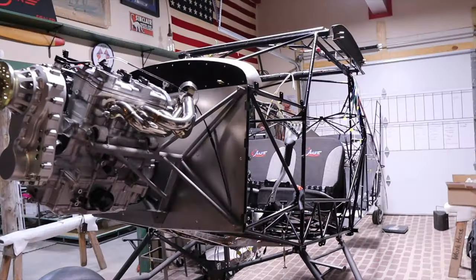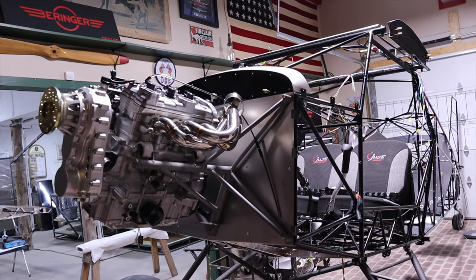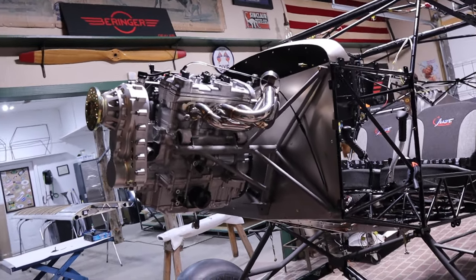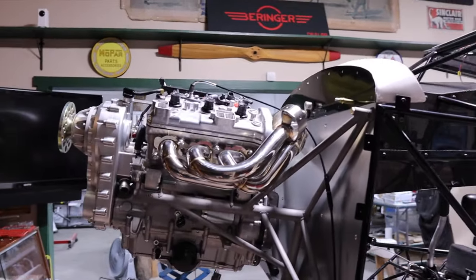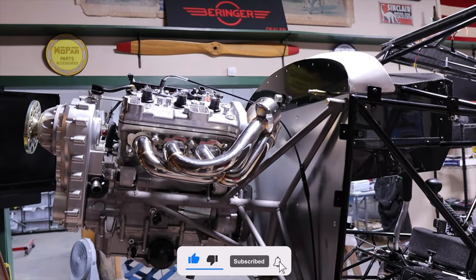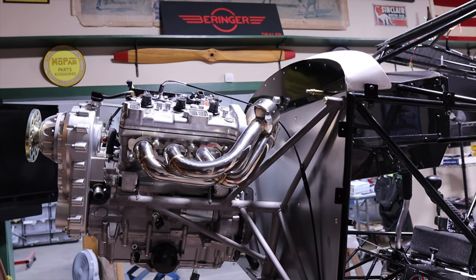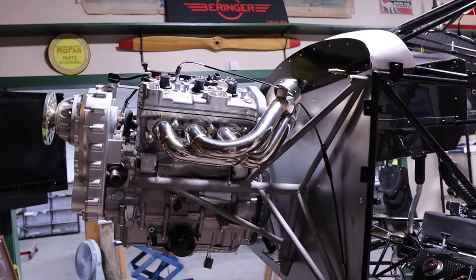Some of the things I am changing is the engine mount. This engine mount is designed for the normal Highlander. I think with the XL version, I can move it four inches forward, do away with the four-inch spacer, and more importantly, keep my turbo in a stock location which makes oil return issues much easier to deal with. Me and a buddy are talking about a possible way of changing the motor mount where you can actually fine-tune a little bit — get your CG more dialed in before you lock everything down. I'm going to try it and I'll probably show you either way.